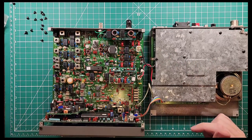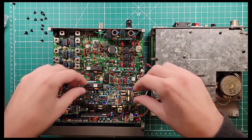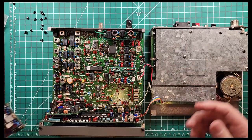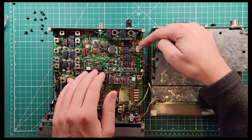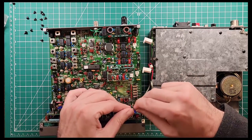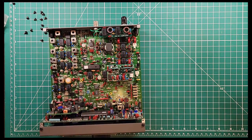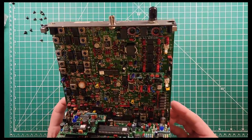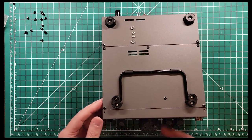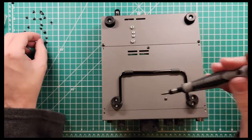We need to get into this area here — this is about where the KSB2 goes. One of the things that are missing is a standoff here to give it some height, plus some pin headers here, here, and here. Remind me: the coax piece goes in the back, the power piece goes in the middle, the ribbon cable goes to the back of the display board, and the speaker wire goes into P5 labeled speaker. The pin headers need to go in through the bottom. I see a bunch of screws missing from this kit, so we'll have to get some extra screws.